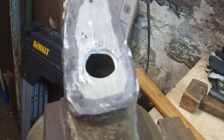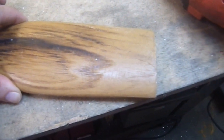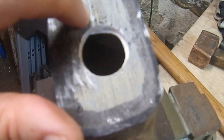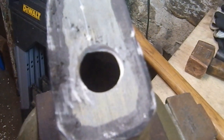Newsflash — this isn't solid. This is hollow, and it goes in quite deep. That's a significant amount of depth, so I'm changing the handle design. I'm going to a solid handle, which I happen to have — I lucked out and found this one. I'm going to do the same process because it's still approximately the same width: drill that, then drill out or cut out the middle part, and bring it all the way down so the shaft can sit on the inside.